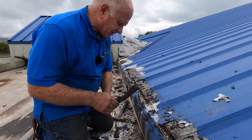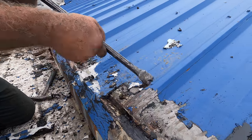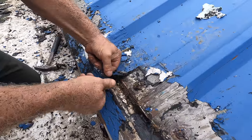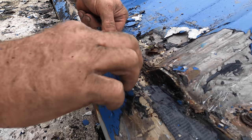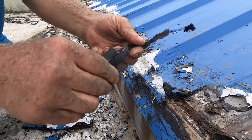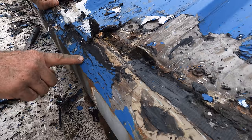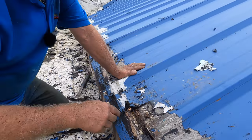The people who originally came to repair this roof did a very good job, but they used tar. You can see the tar with mesh — fiber mesh. That's what they used: they put mesh and tar over the whole area. Regardless of how well they did it, the tar did not last.